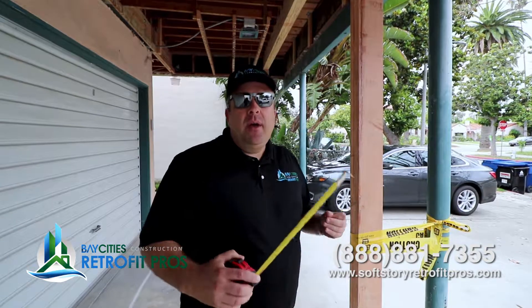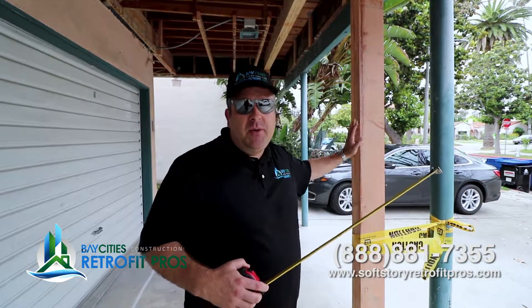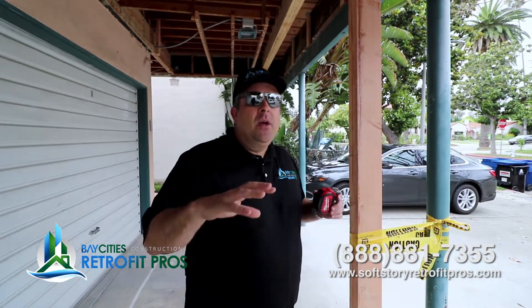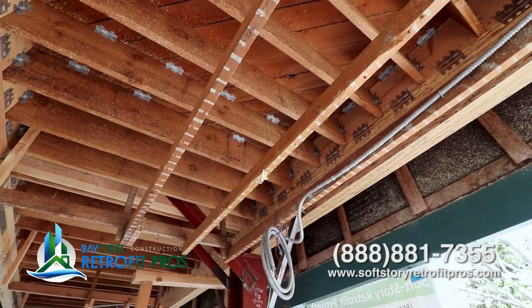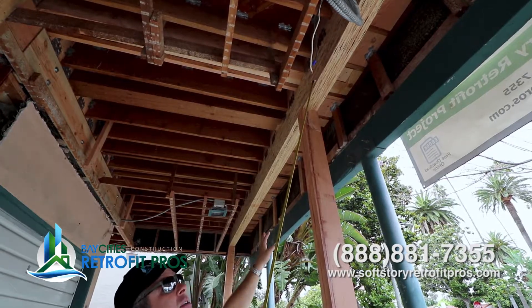Let's talk about how we're connecting new lumber to get a successful transfer of load. The earthquake hits the building, seismic forces affect it, and you want a buffer between the new steel in this location and the existing wood. You have to understand this wood is very old — it's been exposed to water damage, dried out, and some sections have termite damage. What we want to do is create a predictable load path back to the cantilever by adding new wood. In this case we've installed a one-piece 35-foot PSL beam — an engineered product.